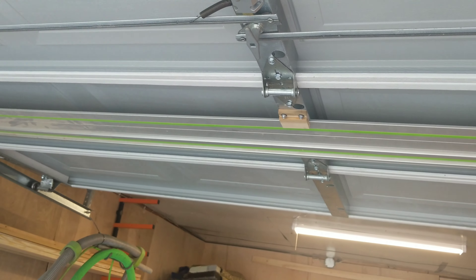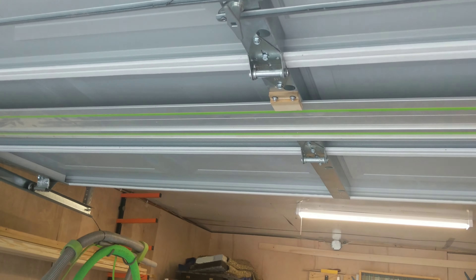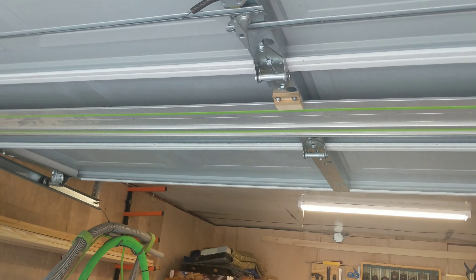There's my almost nine-foot track mounted on my garage door. The one thing I didn't like was that the middle of this big track sagged, especially when the door is up. So I made a little block to support the track in the middle so it didn't sag. And there it is — up there, safe and secure, out of the way until I need it. I hope this helped — check them out, I think you'll like them.